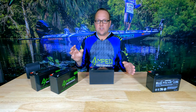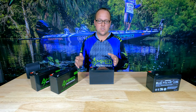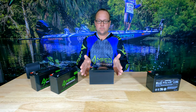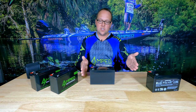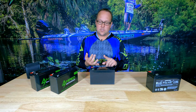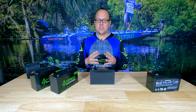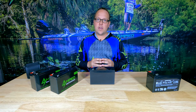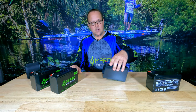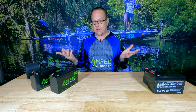The working voltage range of this battery is 12.6 volts fully charged down to 8 volts. Fish finders typically have a working voltage range of 10.5 to 10.8 volts up to 17, 18, or 20 volts — that's the manufacturer's recommended range. This pack discharges down to 8 volts, which is lower than optimal. A lot of fish finders will work at lower voltages, but there are inefficiencies: you're drawing more amps, and you can get diminished sonar return differences. We actually developed a 24 amp hour version of this battery but never released it, because higher voltage batteries perform better.